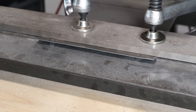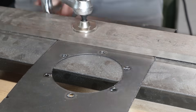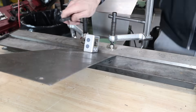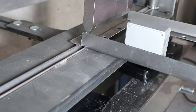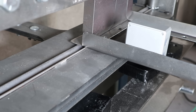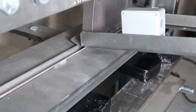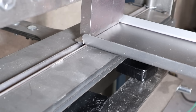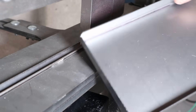This part is definitely the hardest one in the system. It has a series of up-down-up-down bends all at really oddball angles. They have to be placed and bent very accurately because they line up with two side panels that they have to form a watertight joint with. I don't think I could do this part without the pen plotter head. I'm also using my press brake, which has really long fingers that let you get into tight spots for oddball bends. It's a 20-ton press, so it will bend some seriously thick steel, and it pairs really well with the plasma cutter — you can cut out 3/8-inch steel plate and bend it into super strong brackets, saving a lot of time welding.